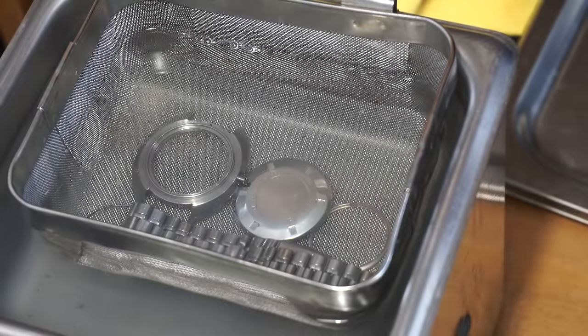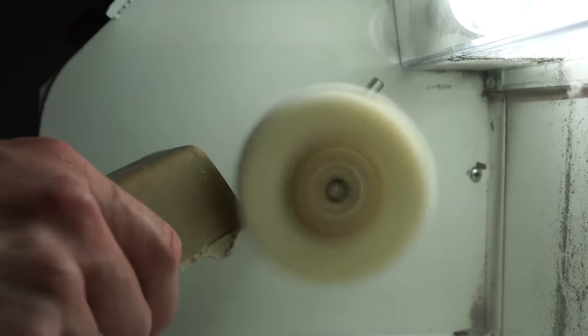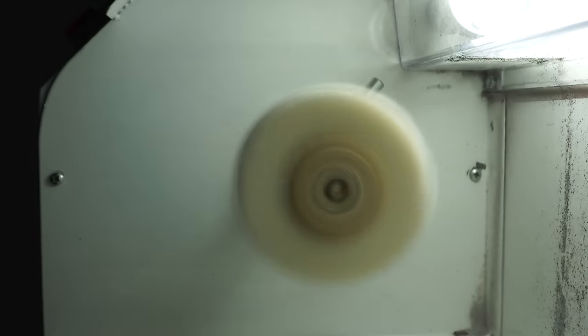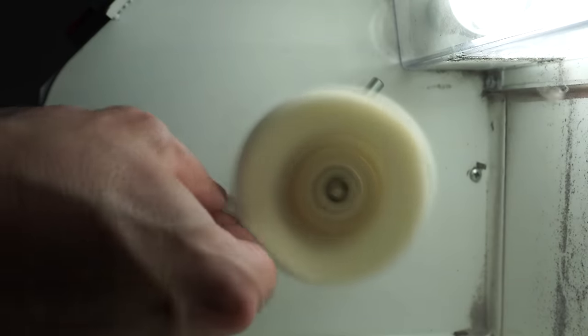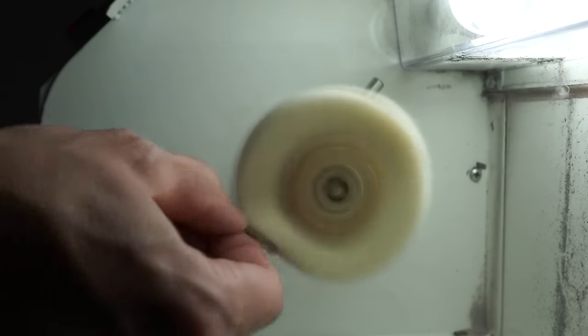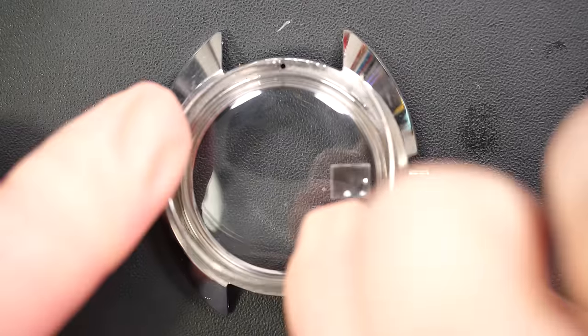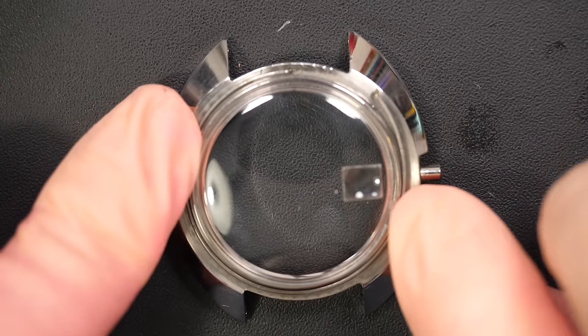Moving to the case work. It came with a bracelet — not the original bracelet — now cleaning it in an ultrasonic cleaner to remove any dirt. It wasn't that dirty, but I always do an ultrasonic cleaning. One important step was doing something about the crystal, so I polished it on my polishing machine — first removing all the rough scratches, then a nice finish. Here is the finished result on the crystal. Now installing the bezel back.